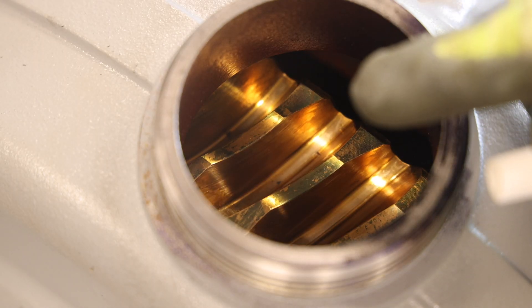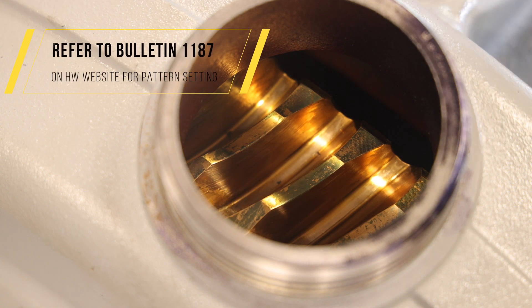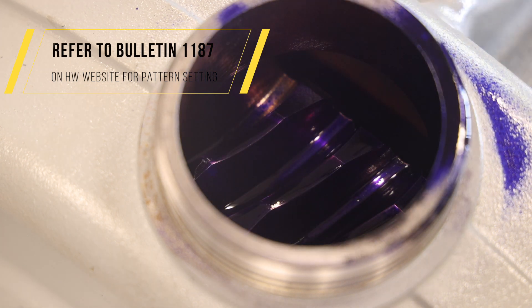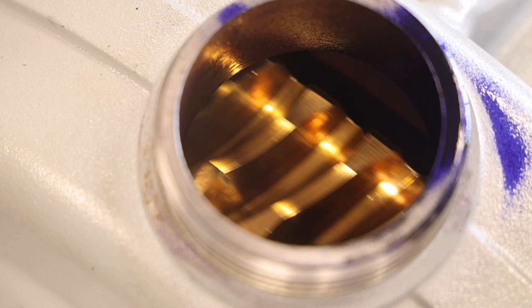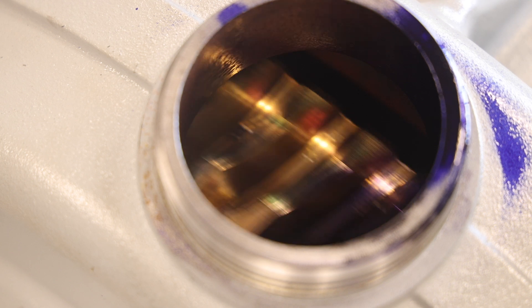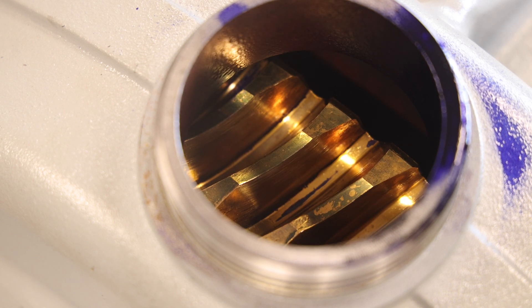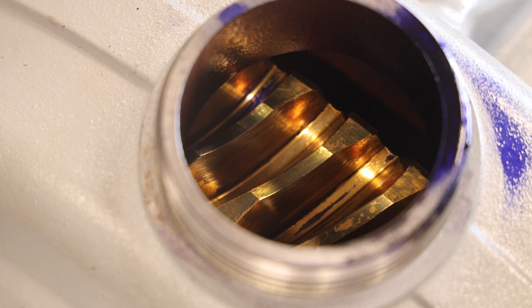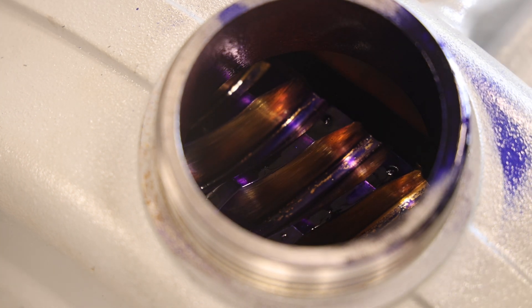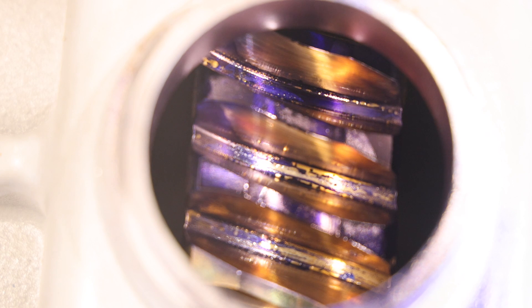Next, remove the oil cap so that the bronze gear can be seen. Then, using the aerosol bluing supplied with the retrofit kit, spray bluing onto the exposed bronze gear teeth. Next, rotate the sheave in both directions and stop the gear where the blued section is visible. Visually check the pattern — the ideal pattern would be a center pattern on both flanks of the gear tooth as illustrated. For an additional visual representation of an ideal pattern, refer to Bulletin 1187 on the Technical Support section of the Hollister-Whitney website. The pattern should be acceptable without any adjustments.